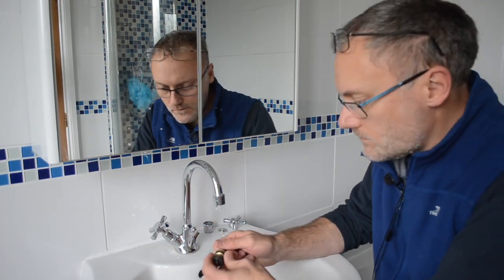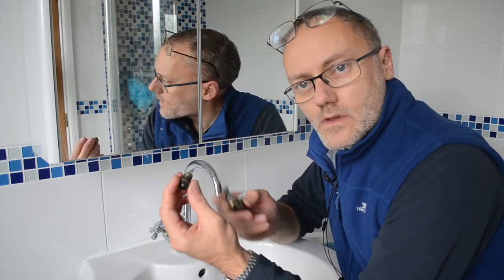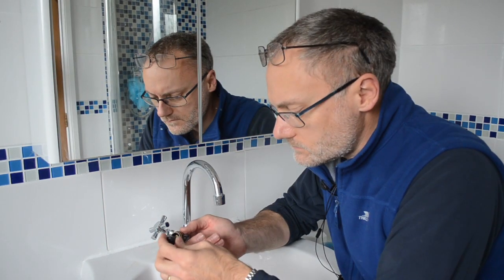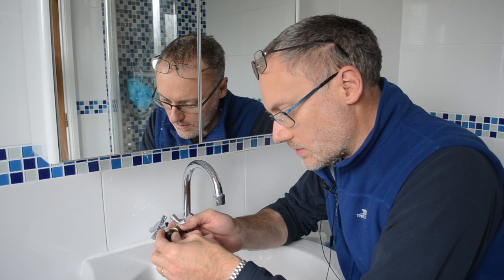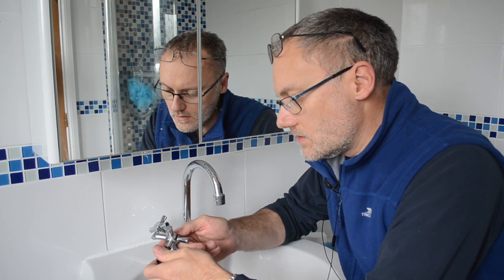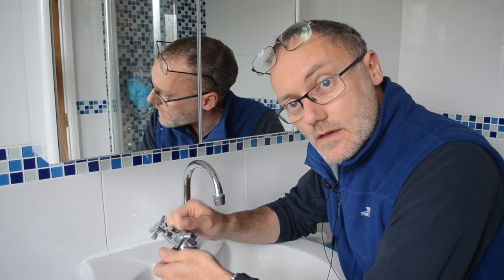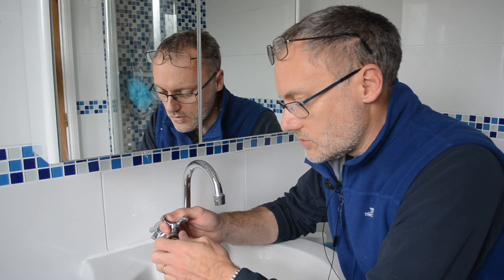Here's the offending unit — just need to sort this out now. The tap easily comes into two parts, and this part has just worked its way down rather too low. I had this happen on the cold tap a couple of years ago, and obviously the hot tap has now done the same thing. So I just need to relocate it back inside and tighten it up so that hopefully when we put the tap back together we should have a properly working unit.